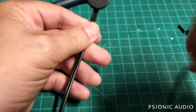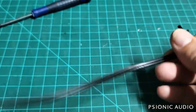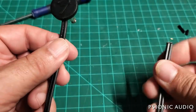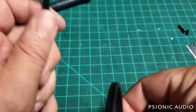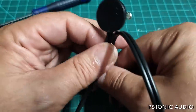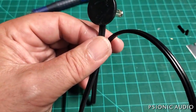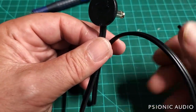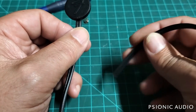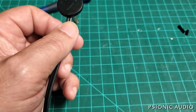I've left almost 20 inches here — a little more than I'll need in a Deluxe — but I'll eyeball that and leave a little bit of slack so there's no pressure on the speaker end, but not so much that there's a bunch of cable flopping around. Let me eyeball that to the chassis and the cabinet, see how long I need it, trim off any excess, and then attach the new speaker before putting it in the cabinet.